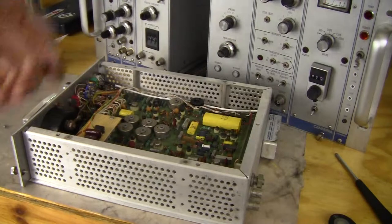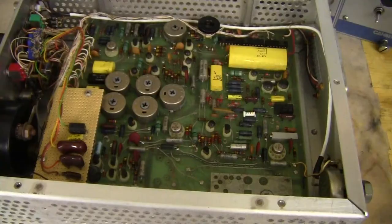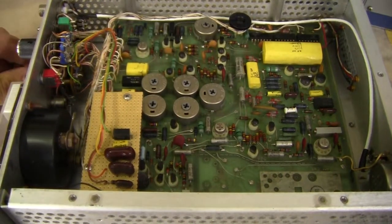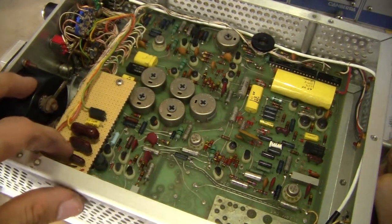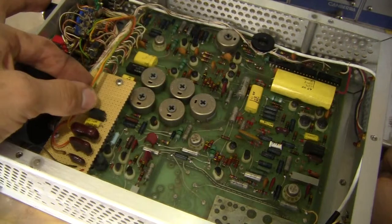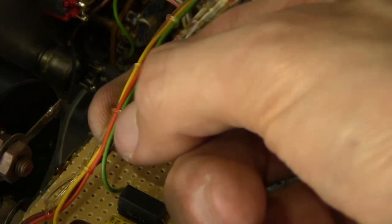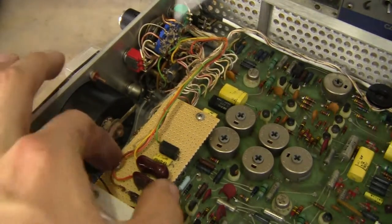Looks like a single board construction. And look at that — we've got a little mod on there with a little perfboard. That might be related to the labeling you've seen on the front panel. Looks like we have the meter right here, the two selector switches — one is the linear range switch and the other is the time constant switch which has been modded. There's also two switches right there, B and C. Looks like what's in the mod board is a capacitor and resistor network. Somehow it looks like it's been done in the factory, because these cable ties are very professional.